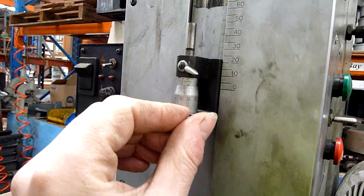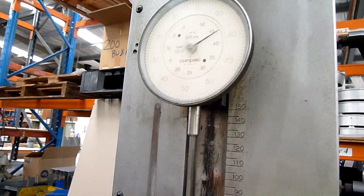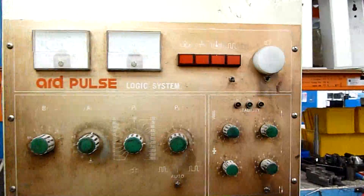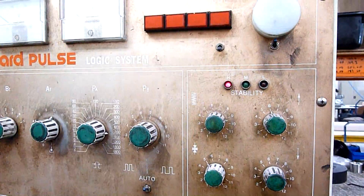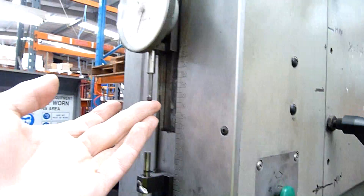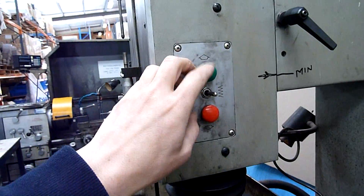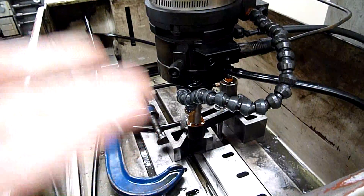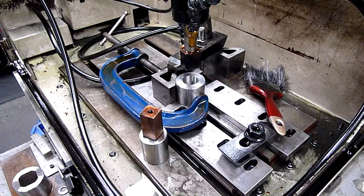That's your depth adjustment. I'm not going to change it, but you've got micrometer control as well as just rough graduations. Once this goes all the way to the top it will trigger a cutout. So if I turn it on — it's cut out. And this will bring the spindle up and it releases the alarm and everything. Reset. Spindle speed.